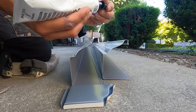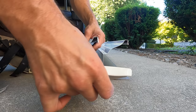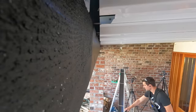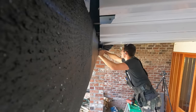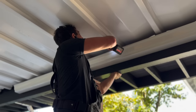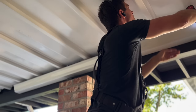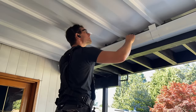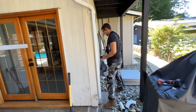As for the gutter system, there are numerous options out there, but I would just recommend finding one that's locally available and fits within your budget. This was a metal-formed gutter system from my local hardware store, and I applied the sealing adhesive specifically designed for gutters. After I have the end cap on, I position the fastener locations accordingly — six inches from the ends and 24 inches after that. The installation process is quite simple: just follow the chalk line indicator to guarantee proper slope as you're installing. The gutter system has brackets that connect each section together to avoid leaks, and once installed, all you have to do is figure out where the downspout needs to go and you're done.